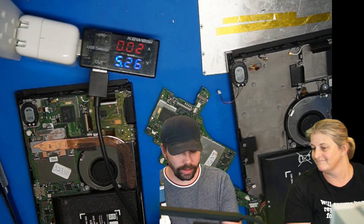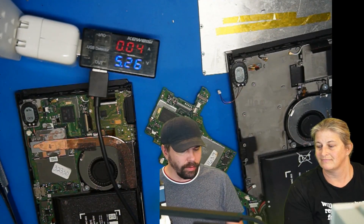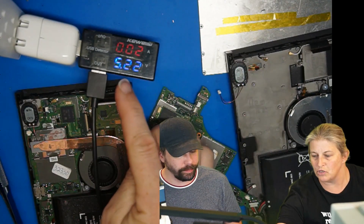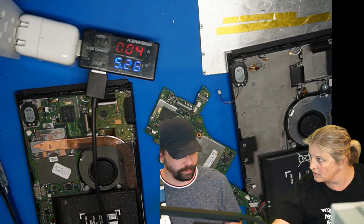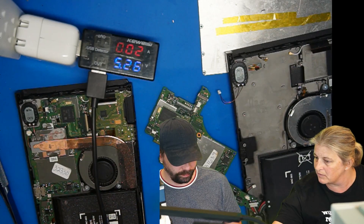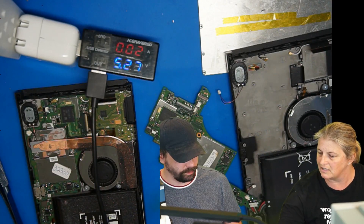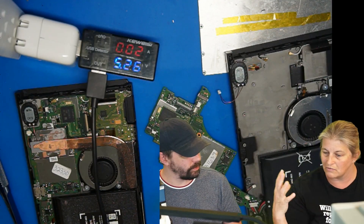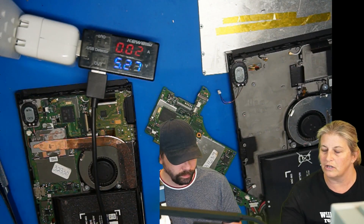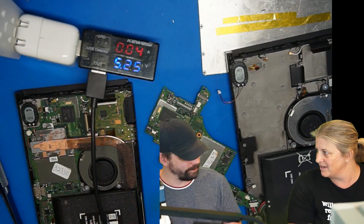We've got one here that we can see is only consuming 20 to 40 milliamps when it should be over half an amp with my USB to USB-C cable. This is a USB ammeter, and we can see the push of voltage from the charger pushing into the logic board, which should get magically converted into a high enough voltage to charge the battery. So the charger has to be recognized, it has to make connection, and then there's a charging circuit that uses a logic chip, a coil, and a capacitor to create that charging voltage and charge the battery. If there's little or no current, the push is there but there's no cars on the highway — something's wrong in the circuit.